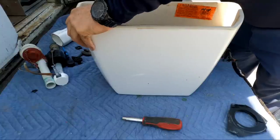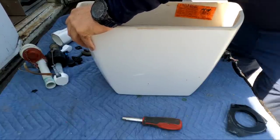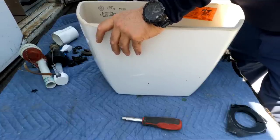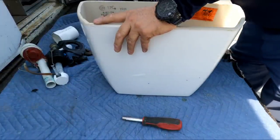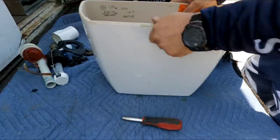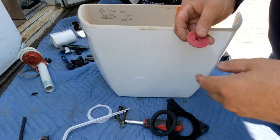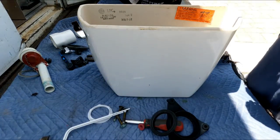What I did was put a pressure gauge on the system and let it sit for 15–20 minutes and it never budged — with the curb stop shut off. First I did it with the backflow turned off, and it's not moving. I can't find the leak. Alright, let me get my stuff: a handle, a flush valve, a new Kohler fill valve. I got a new handle on this toilet.